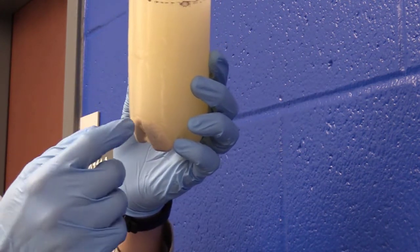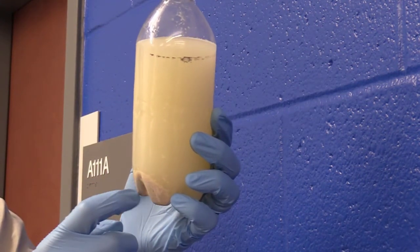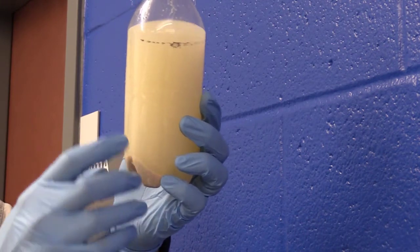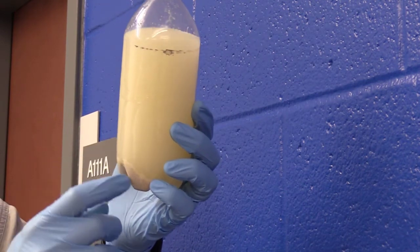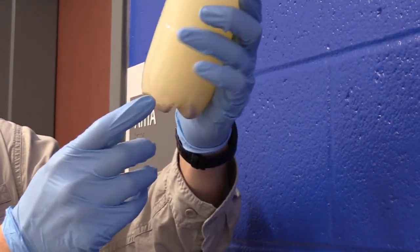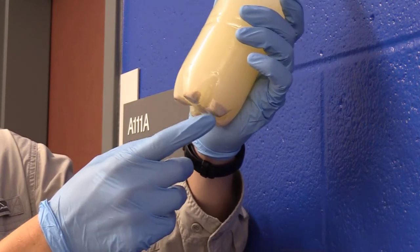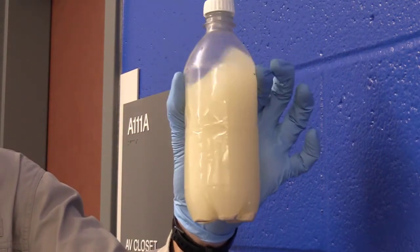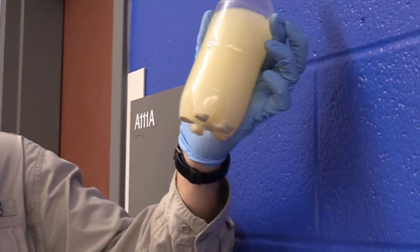What happens is as those granules went into the tank, that layer of oil coated them. The way dry granules work is we're trying to get them to dissolve into solution — it's like putting sugar in your tea. But when we coat these in oil, they're never going to get into solution, or they're going to take forever and need way more agitation. These undissolved pellets are going to cause a lot of issues with your nozzles and screens — clogged screens, clogged nozzles — and you're not getting this product to the field the way you need to. That's why dries go in first, certainly before any adjuvant or oil-based product like an EC.